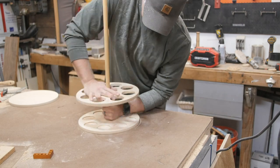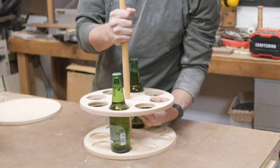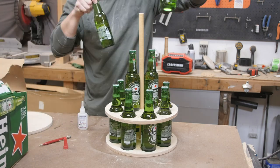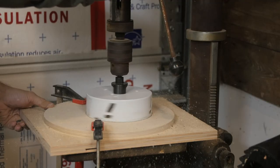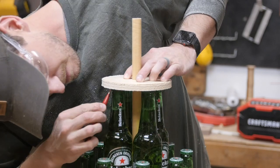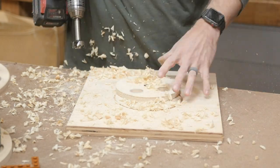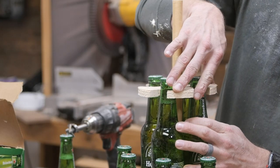From there, I started to assemble everything and figure out exactly how big this thing needed to be in order to hold all the beers. I laid it out, started stacking things together, figured out where I needed to cut the dowel, and then started gluing everything together. With the bottom knocked out, I could move on to the second row, which is only going to hold four beers. It's a little bit tricky because I need to make sure you could still get the bottom row out and the top row out at the same time. So I decided to cut a six-inch round to go on top — I did that with a six-inch hole saw on my drill press. That's a little sketchy; you could do it by hand, but there's a lot of torque with the six-inch hole saw, so just be a little bit careful. I drilled holes for the necks of the bottles to pass through, then notched out a little bit of material so you could slide the beers in and out easier. Once I had it where I needed it, I could glue it in place and that part was complete.